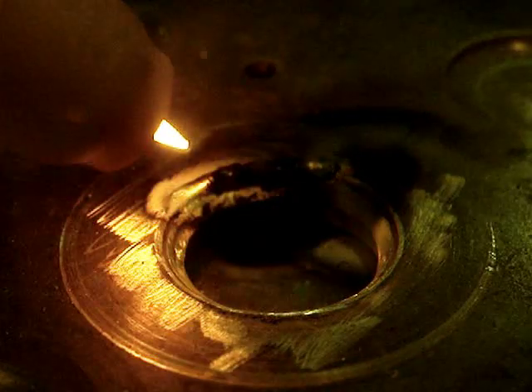What I'm doing here is trying to keep the heat on the puddle, on the weld metal, and not on the base metal. I hit it with a little pulse — a little blast of amperage — while I dab a little rod in there, and then get back over the puddle. That seems to work okay for building up areas.